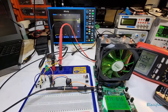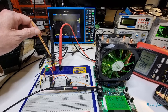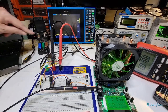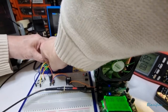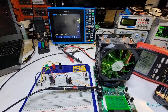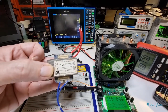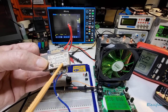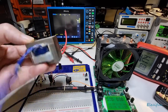This little transformer is doing its utmost and it's straining — that's why we're seeing the voltage drop down. So we're going to quickly swap it for a slightly bigger transformer to see if it makes much difference. This slightly bigger one tells us where the primary and secondary are: the reds are the primary and the blues are the secondary. This one is rated 12 volts at 20 VA.